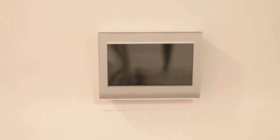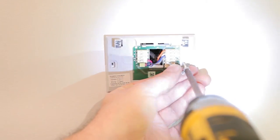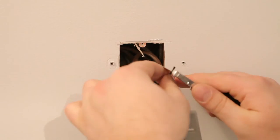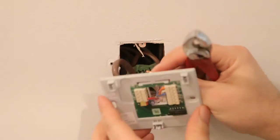I headed over to my breaker box, flipped the switch, and left it running so you could see the whole boot-up process — and found that nothing happened. So I had a look at the instruction manual, and it looks like it's expecting another wire to be used. The quick startup instructions show a wiring diagram using the C, G, Y, W, and R wires. I'm short on those, so I'm going to use one that's not being used and attach it. I'll need to go down into my crawl space and check to see if the wire is attached on the other side — I doubt that it is.